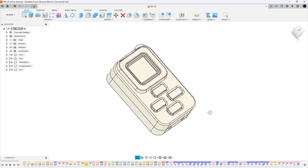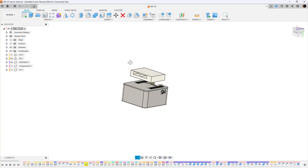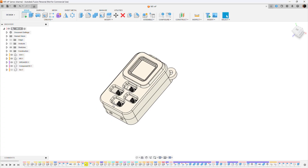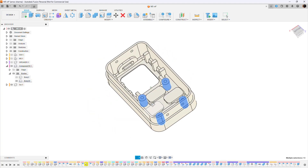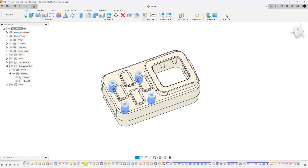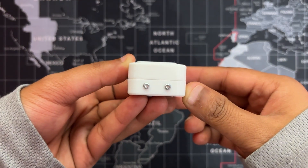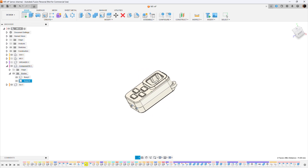To begin the design of our handheld wearable device, we imported the 3D model of the M5 Stack Atom S3 into Fusion 360. Since we didn't have the speaker 3D model, we created one manually along with a custom switch PCB that features 4 push buttons. We then built a simple box-style enclosure around the display area. The front section houses the switch PCB, where we added 4 custom switch actuators. To secure the switch PCB, we included 2 screw bosses with 1.8mm holes, sized perfectly for M2 screws. To join the front and rear sections, we added 4 M2.5 holes and plan to use M2.5 Torx screws for a clean, secure fit. The enclosure was sized to fit comfortably in anyone's hand, making it easy to hold and interact with.